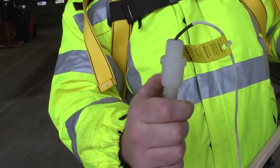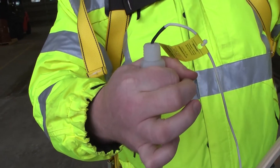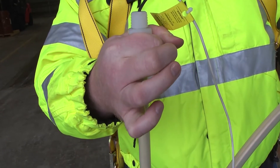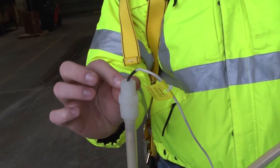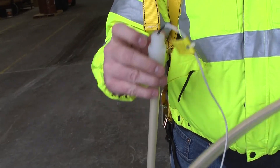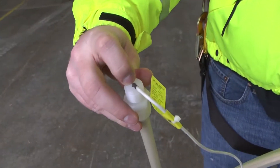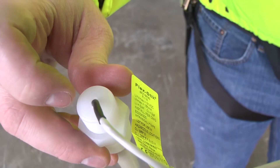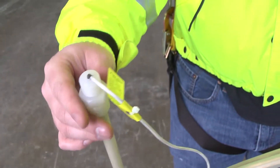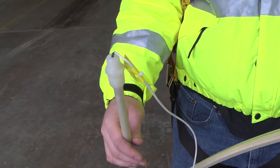You have this three-quarter inch connector here. You want to make sure that you have a coupler that supports it in the tank. And you want to make sure you put a junction box over top of this opening here, because this isn't sealed in the top of this probe. If you get water in there, it will actually cause the probe to short out and it will corrode over a period of time and you'll have to replace the probe.